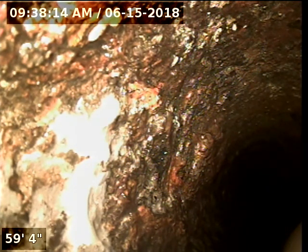Here we are. The bedroom that we needed access to is locked. There is also no front clean-out. When they removed that backflow, it looks like it was cemented over, so we have no access to it.